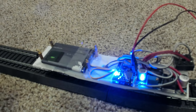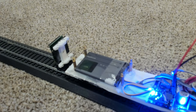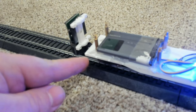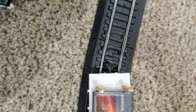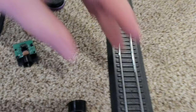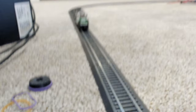The difference between the original design and this one is that now the camera is fixed on the front of the car — just glued in. Unfortunately, having the camera extended out past the edge of the truck means that as the car goes around curves, this edge swings out over the track. The camera ends up looking off to the side, away from the curve. Because Pi cameras have a narrow field of view, it basically looks like you're looking off into the distance at nothing — the track goes off screen.